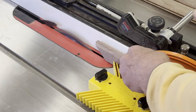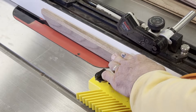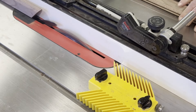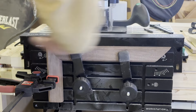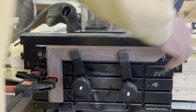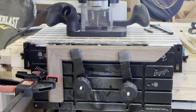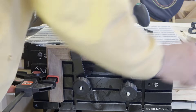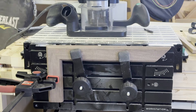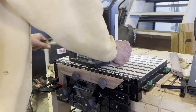The frame spins around so you can use both sides of that plate for the magnets, and because of that the frame pieces are also symmetrical — there's no front or back to them, they're the same on both sides. This is the setup for cutting the 10 millimeter holes for the pivot dowels. That little vertical piece on the left side is just a piece of scrap at the same 45 degree angle as the boards, and I use it to line up each of the short frame pieces in the same spot to make it easy to cut those 10 millimeter holes using the Shaper Origin.